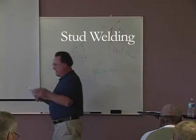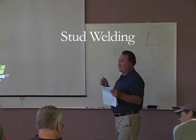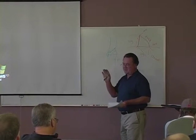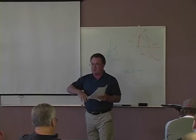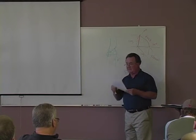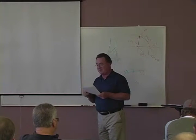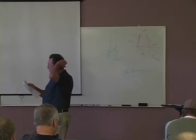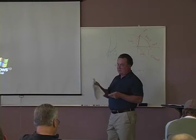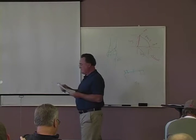The next page covers stud welding. This is another issue when it comes to automatic stud welding — if you're putting in an MSE wall, you may have to deal with that. Give us a call — we want to come out and support you on that. They have to weld a couple of studs and do some destructive testing. One of the main reasons we put this in here is because we have a lot of manual stud welding. So all of these things — like section 7.4.1 — must be free from rust, rust pits, scale, oil, moisture, and deleterious matter. The next section states the area shall not be painted, galvanized, or cadmium plated.